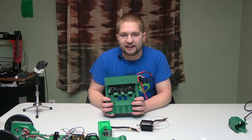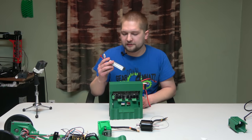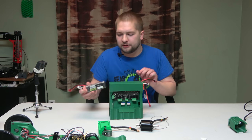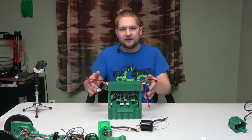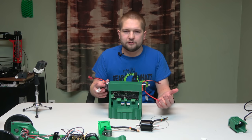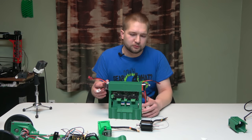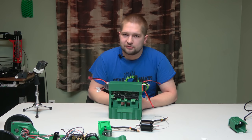As you may have seen in the last video, I spent a lot of time CADing this design so that we're going to have four 12-volt 2,200 milliamp batteries. There's going to be two on each side — two in series and two in parallel — for a total of 4,400 milliamps at 24 volts. That is the voltage this O-Drive is meant for, and that means it should work.